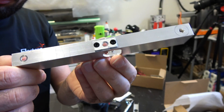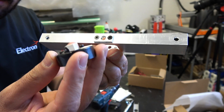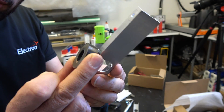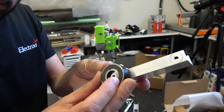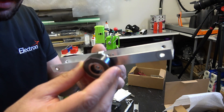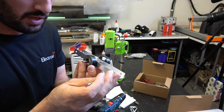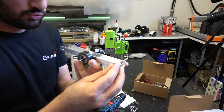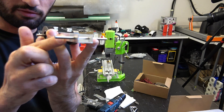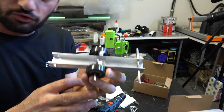I had to put these two pieces of aluminium in here — 1mm thickness — and that is for locking the brake magnet. This bar should not be rotating, so it's locked now. Then I can just install and add the axle inside, and this will allow the brakes to basically work. They fit nicely. Now for the four remaining wheels, I need to make some spacers to match the distance between the two wheels, and I will 3D print these. I think it's around 11mm, so I'll design them quickly and print them, then try to fit everything together.